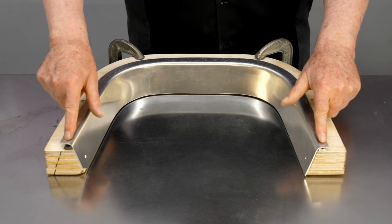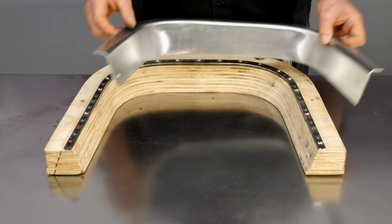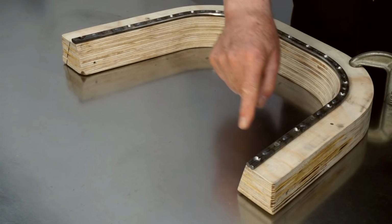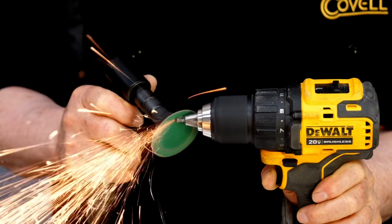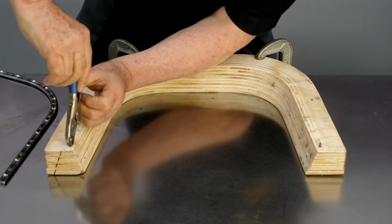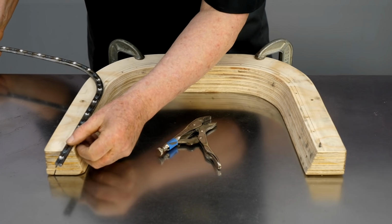I want to put two holes in this top flange, so each time the part goes on the form, its position will repeat accurately. So I'm going to make two pointed screws that go in these holes. So I'll use vise grips to hold onto these pointed screws to allow me to screw them into place in the front two holes on the hammer form.